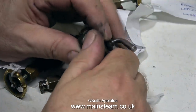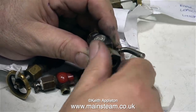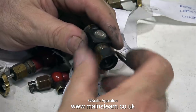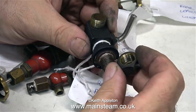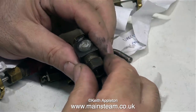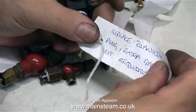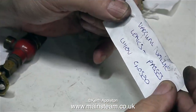I called into the steam workshop to pick up some parts for the locomotive, and Simon Hudson presented me with a bag full of old steam fittings. Attached to each steam fitting is a label which says what the problem is and what's required. This is the top fitting of a water gauge, and the inspection plug's sheared off, so I need to drill that out and make a new one. Also, the owner of these parts needs another nut making because he's lost the one for the lower fitting. It says: replace blanking plug, extra glass nut required. And once I find out what the thread is, I'll just make one.